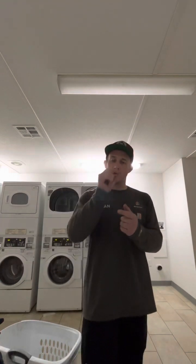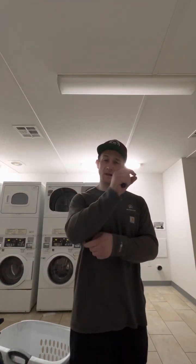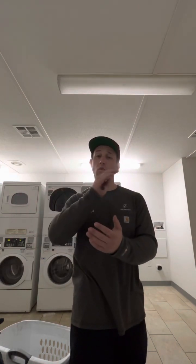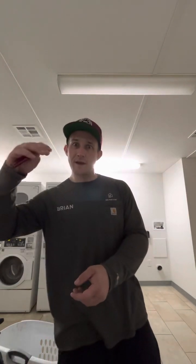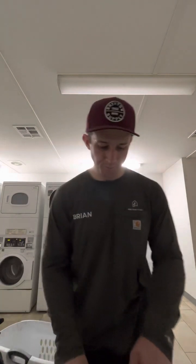So you go around to every single thing, you make your list. What I tell you, you need to get the voltage that it says on the back of each appliance, whatever you're plugging in. Write down what the voltage says. It's either going to say 120, and then it'll show you the wattage or the amperage, or it's going to say 120 to 240. It'll show you the wattage and the amperage. Document it word for word.